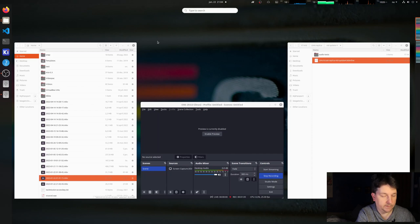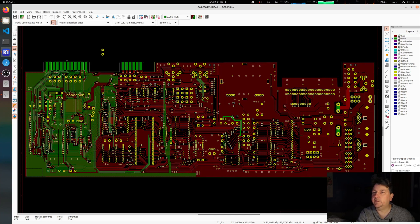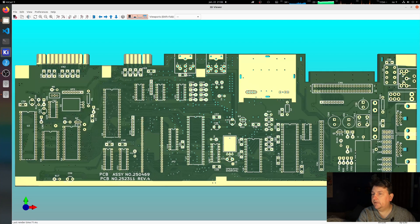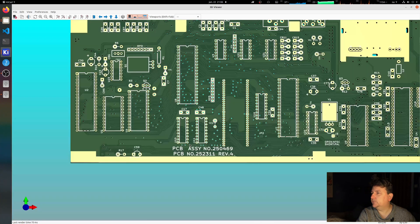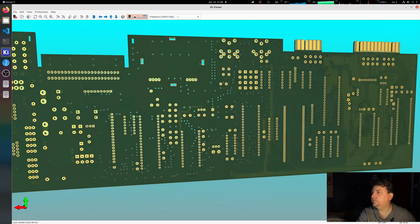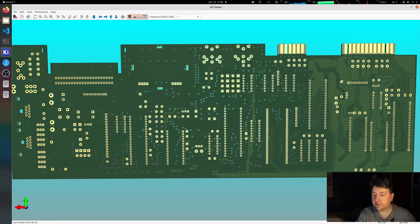Let's have a look at the progress. I'm using KiCad Nightly. The top layer is red — as you can see it's pretty much done. The bottom layer is green and we have come a long way. I might need some more masks around here. We can see we have a slant line over there, and we have something weird going on here — we didn't see that. But it's mostly done on the top side. And on the other side, we have most of the stuff done on the right side. We need some holes in the mask.